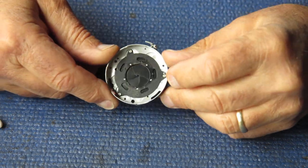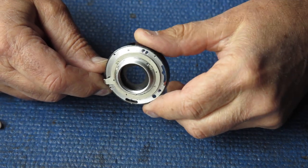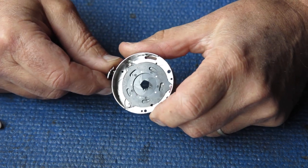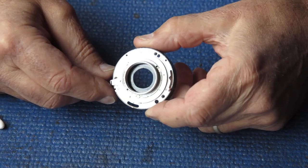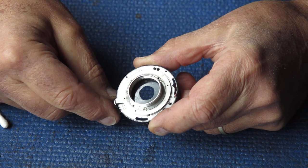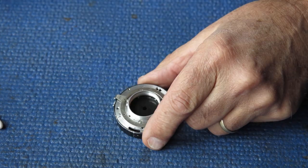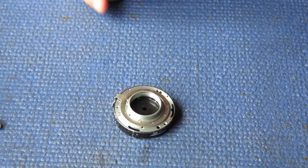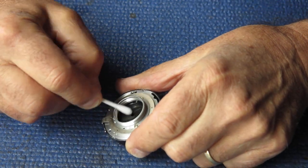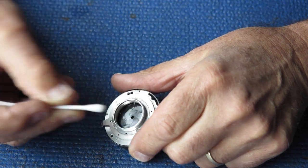Here I've got the diaphragm mechanism from a Synchro-Compur shutter, just like the one in that Retina 3C shutter I showed earlier. This one is stripped down to the basic so you can see what's happening - it is very, very oily. The blades are very stiff to move. You might even see that they flex slightly as I move them - that's because the blades are pretty much glued together with that oil. So just for demonstration, I'll see if I can clean those blades a little bit with solvent on a cotton bud and make a serious dent on that oil.